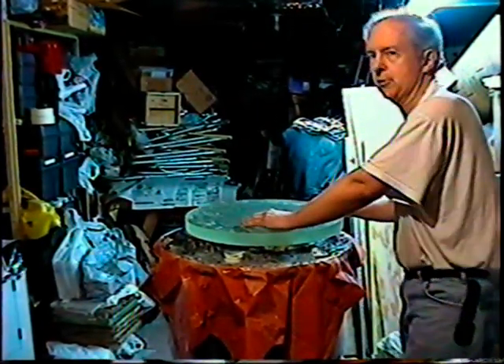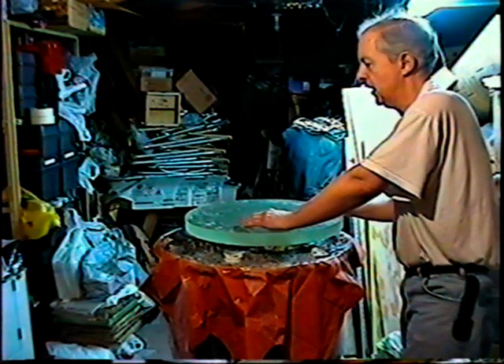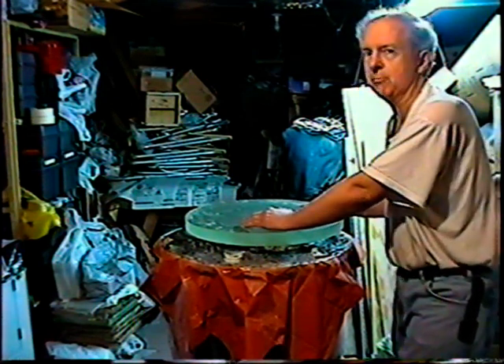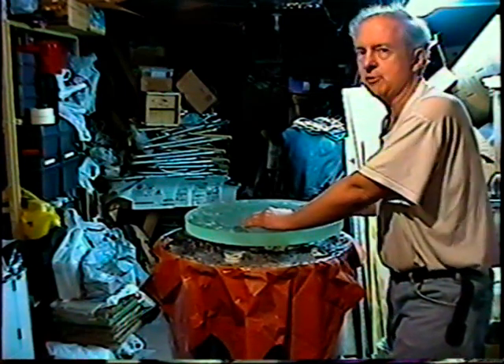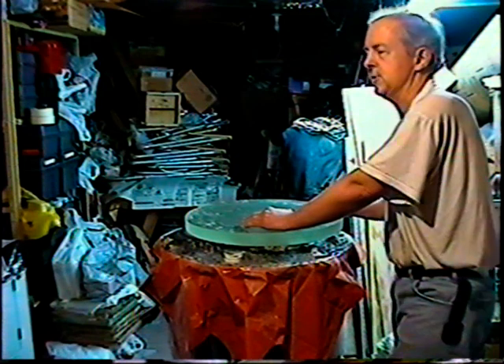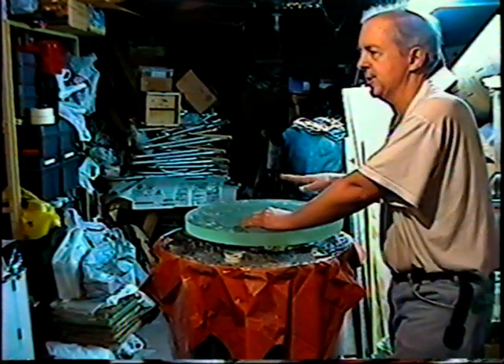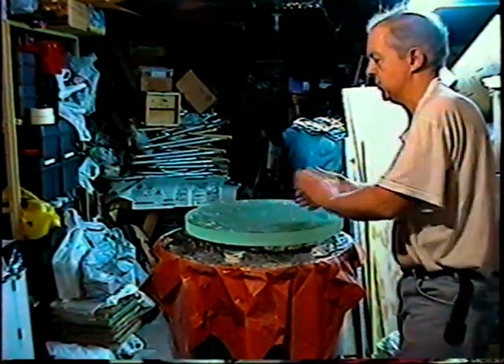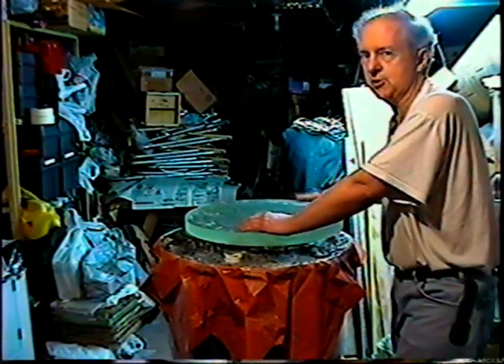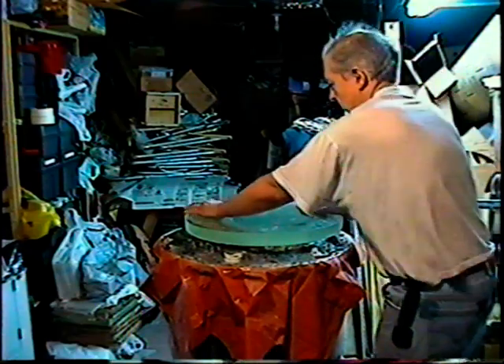As I proceed, you're going to hear the sound soften very quickly — that harsh grinding sound disappears into a soft sort of murmur. At that point, the abrasive is really not much use anymore because it's worn down into a much smaller grain size, so it doesn't cut the glass effectively and you might as well replace it with a new dose. You're just wasting your time if you prolong the wet, and you run the risk of the tool and mirror sticking together, which is not a good thing.